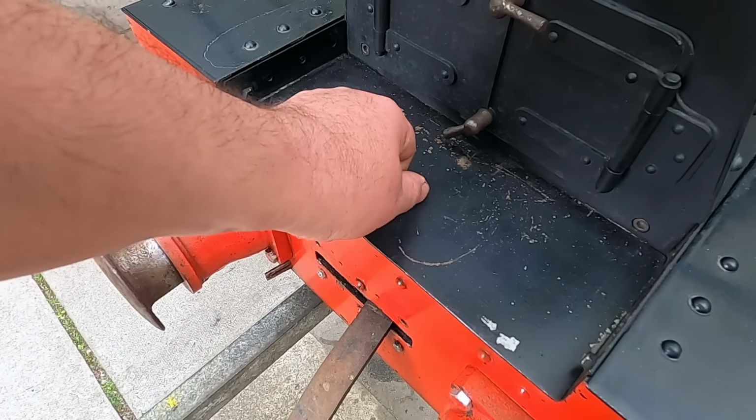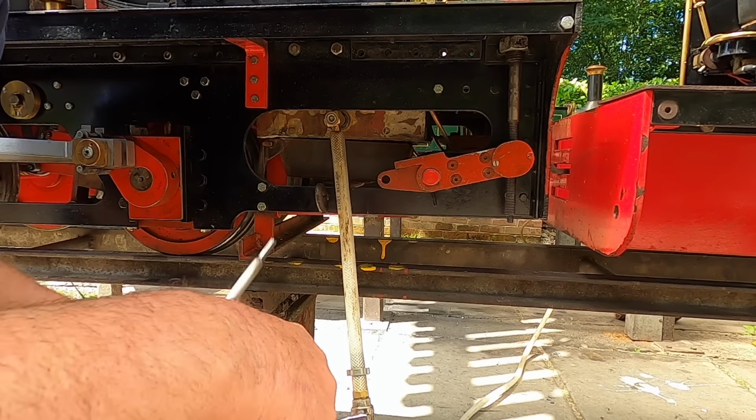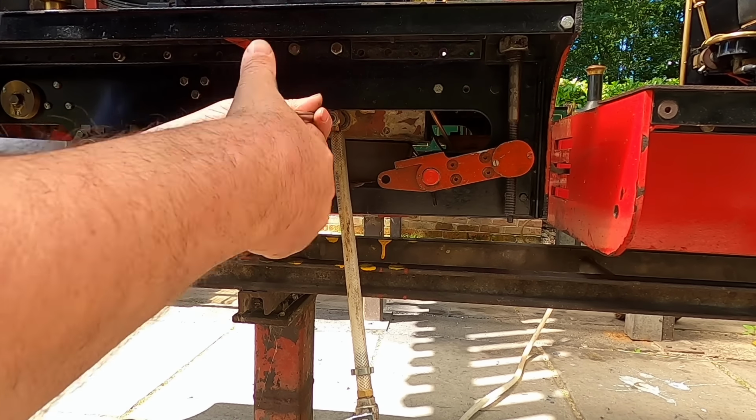Now, to fill the boiler, we're going to go through the blowdown valve here. And we're just going to push this pipe on. Now, as this is a copper boiler, we don't need any boiler treatment in. So we shall open that